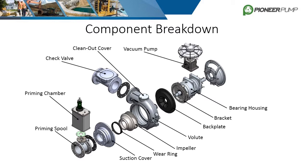The vacuum pump is either bolted to the top of the bearing housing or it can be mounted on the side using a separate bracket, and is powered by the shaft. The last major piece is the SAE bracket, which is used for mounting to an engine. If the pump were to be coupled to an electric motor, this piece would be replaced with a bearing cap and referred to as bare shaft. Gaskets or o-rings are always required when bolting any two metal components together that are exposed to fluids to prevent leaking.